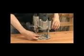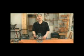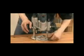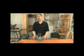We have a new multi-step turret that includes 2 adjustable stops, so the user can easily make multi-pass cuts that have a total depth other than an 1/8" multiple without having to do any fine adjustments. We have the polycarbonate subbase. We have enhanced bosses for the mounting of the router guide. And of course, the smooth plunge action that people expect from a Bosch plunge router.